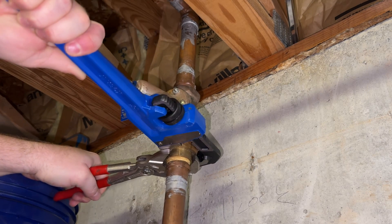Whatever you do, don't forget to put this ring on first and make sure it's going the right way. Get it nice and tight and then finish it off with a pipe wrench or something where you can have a hold back. I will caution you that this is brass so it's very soft, and if you get it too tight you'll bury the threads and ruin the fitting. Make sure you install this so that the arrow points in the direction the water flows. Putting teflon tape on the inside and pipe dope on the outside not only helps with making a watertight seal, but the pipe dope also acts as a lubricant which requires less torque and helps install the fitting.